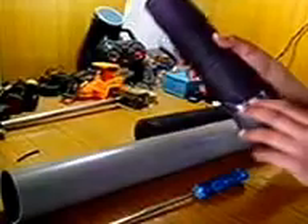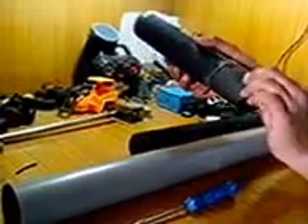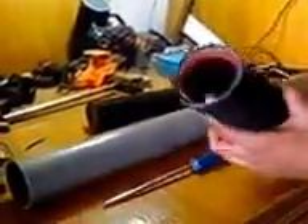You have to take a sheet which should be hard enough to support the load of the lens. You can see here, I have made my own sheet which consists of paper and cloth wrapped around it. This provides very hard support for my lenses. I have used two lenses — the objective is of power 1 and the eyepiece is of power minus 20.